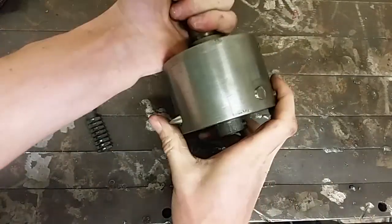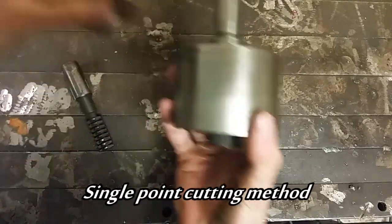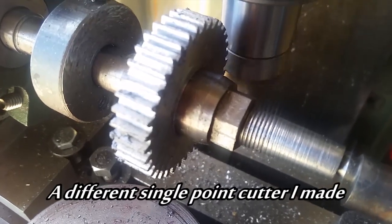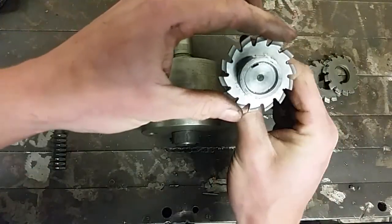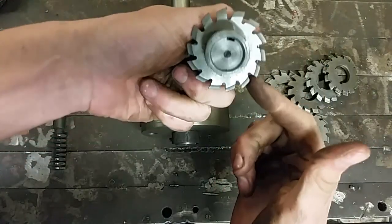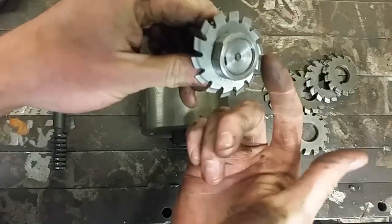Next up, my old beefy fly cutter slash form tool. This method was much faster than hobbing, but I had cheap high-speed steel that just got dull too quick. And lastly, these are just import gear cutters — I'll leave it up to you to work out where they're from. These actually work really great. You can push them quite hard and take them to full depth of cut and it's not an issue. Even the import ones cost quite a bit but they do seem to be quality.